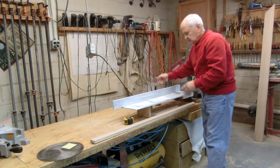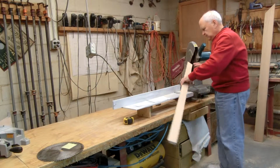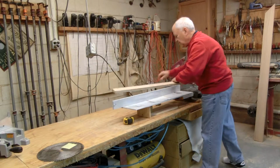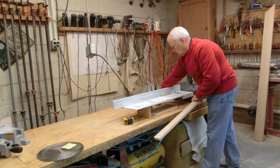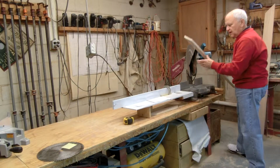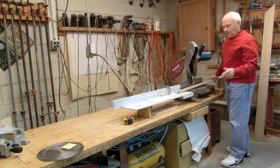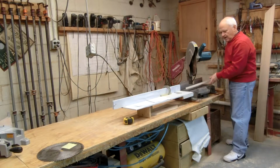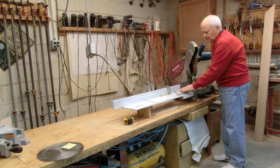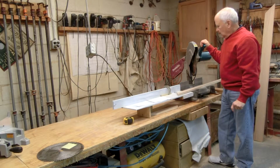Well, I was building some kitchen cabinets, and so I had my stock in long pieces. I wanted to miter the corners at 45, and then I set up a simple stop with a clamp, and then I could turn the piece upside down and cut the other side. Normally you have to flip the saw over here, cut one side, flip it over there, back and forth, back and forth. I needed several pieces, cut them all at the same time, front side, back side, put them together, came out beautiful.